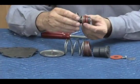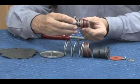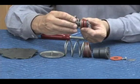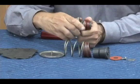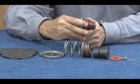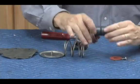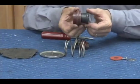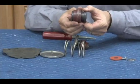So the stationary spacer, as I mentioned, the name implies, stays stationary. As that 100-pound pressure that we just discussed causes that stem to move, the stem pushes across like that and closes on the relief valve seat. As the pressures change, it comes back and travels back and forth. In other words, the stationary spacer stays still. The diaphragm, which is attached on the back side here, moves back and forth, causing the stem to move like this.